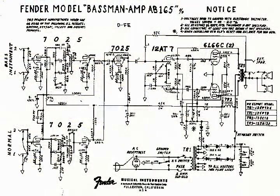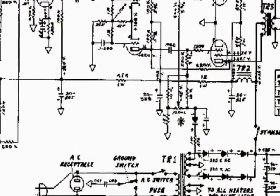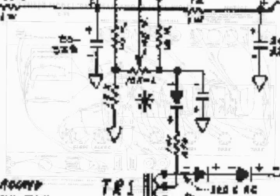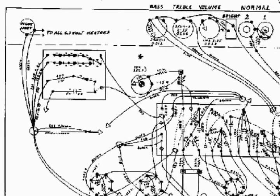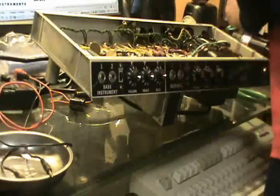Finally, we come to the bias supply capacitor, a 50 microfarad 50 volt electrolytic. Because the output here is negative, the capacitor is installed with its positive plate at ground. Do not forget to pay attention to this polarity. The cap is located on another double fiberboard phenolic, which is under the chassis directly above the power supply transformer. This board also holds the rectifier diode.